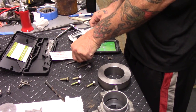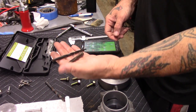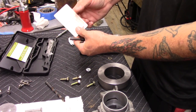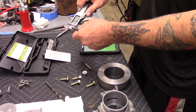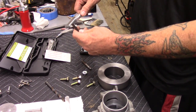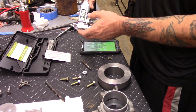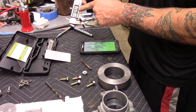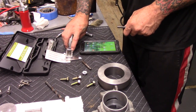The way you figure your drill taps, like if you have a 5/16 tap, just Google it. I mean, I got charts and stuff, but you can Google it and it'll tell you. Then you can convert it to thousandths of an inch and check it with something like this, because most drill bits you can't read anyway. I can't anyway.